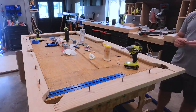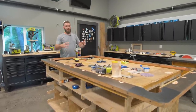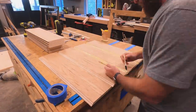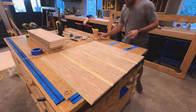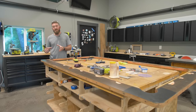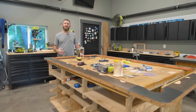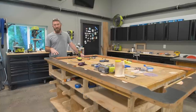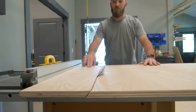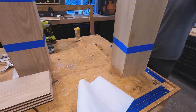The legs on this original pool table were kind of inset — just the old school pedestal legs. However, for this makeover, we're going to be building eight-inch square, big beefy legs on each corner. They need to be that big because the pockets are on those corners and need to recess into the legs. Once I get those legs built up, we're going to miter everything at exactly 45 degrees, tape those up, glue them together, and then follow with some pin nails to make sure they don't come apart.